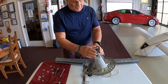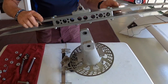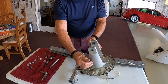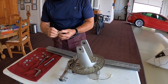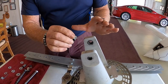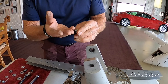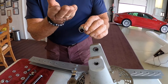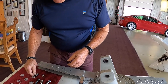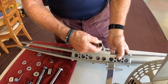For demonstration purposes, this is not the rotor head that goes with this hub bar — you can see how much play there is — but it's useful to illustrate the bushings. These are called teeter towers, and they have little hat-shaped bushings inside them. If you replace these bushings, make sure you get the seam on the bottom, because the weight of the aircraft rests on top — you don't want the weight teetering on the seam. There are short bushings for the teeter towers, and long ones of the same type that go in the hub bar.